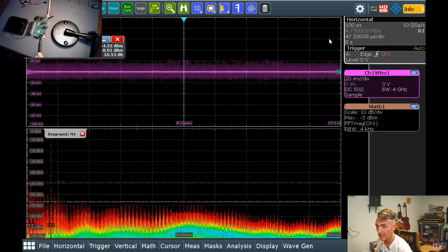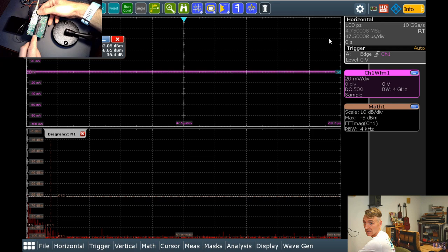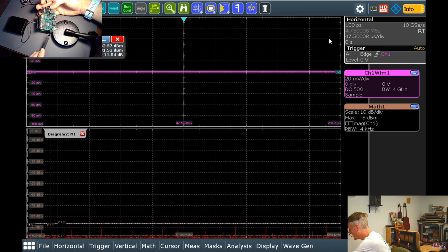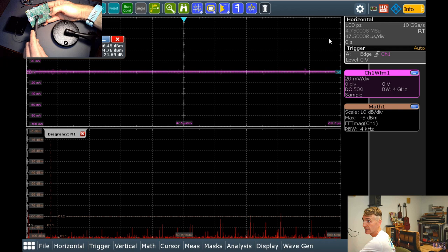Let's check the back of the Raspberry Pi. Okay, back here. Yeah, this is the processor right here. That's the Broadcom processor. All right, so back here, anything? Quiet. Super quiet. This piece of memory. Oh, this isn't memory right here. This is my I/O chip that's talking to the Ethernet and to the USB. Oh, my Ethernet fell out. I'm not using it, so it's not a big deal. Memory on the back side, super quiet.